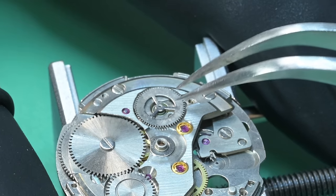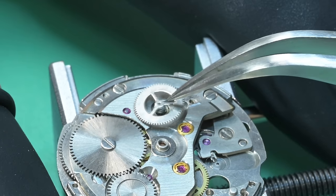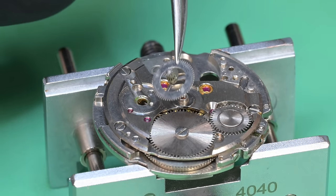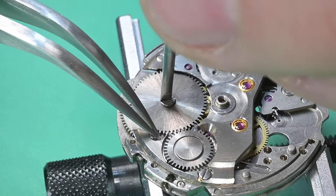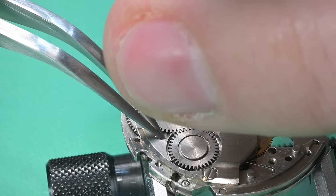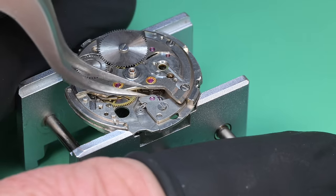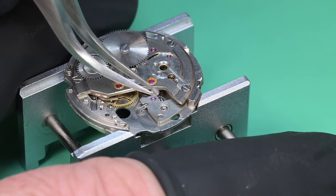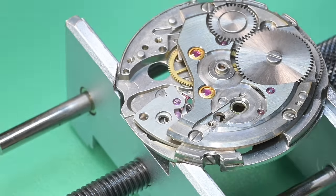Mechanically they are extremely good watches. Value for money — especially if you want to get into restoring vintage watches — Seiko Lordmatics are really overlooked in my opinion. The quality of the movement, the case, the dials for what you pay is just fantastic. Some of the faceted crystals can be a challenge to source; I've actually sanded down slightly larger crystals to fit because you just can't find the original part.